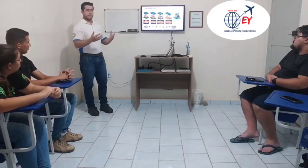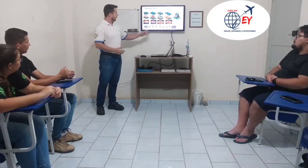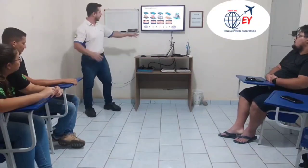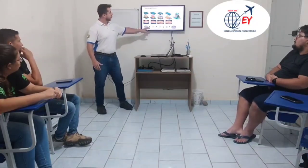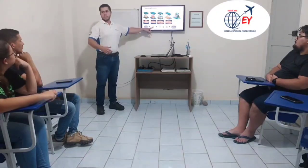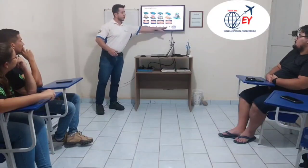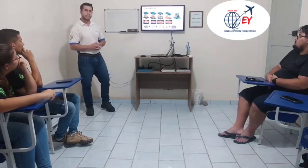And in the stamping line process, you use many press machines to stamp the blank. You start with the circular blank, and finish with the disc. The press machines range from 200 tons up to 2,000 tons.